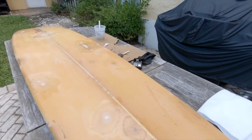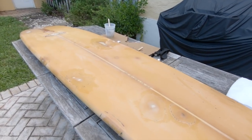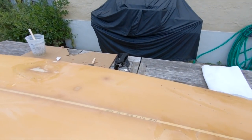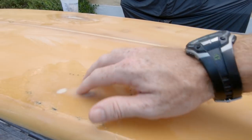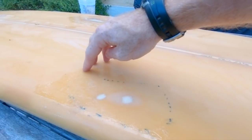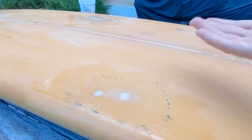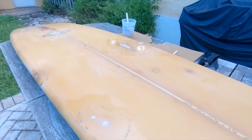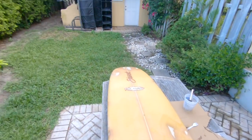The plan of attack is we're not even going to do much sanding — you can get really lost in sanding and applying, sanding and applying. We'll give it a very brief sand just to roughen up the surface and make sure everything sticks, but it's going to be quick. Then we're going to take our epoxy and mix it with something called micro balloons. Micro balloons are a type of filler similar to what we used in previous steps, but they sand really fine and really well.